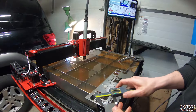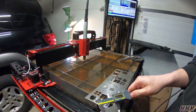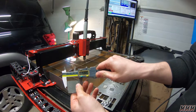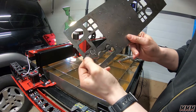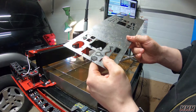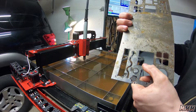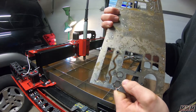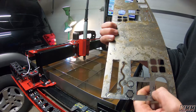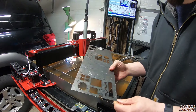Now it's too big — but that is exactly what I was going for to bracket the right value. There's some slag on here, but that is close — wow, that is nearly perfect. That's just with one tab. Our little hexagon here — here's the bottom. I think it may have actually cut a little worse this time. Same settings other than the kerf. Some things to work on still.